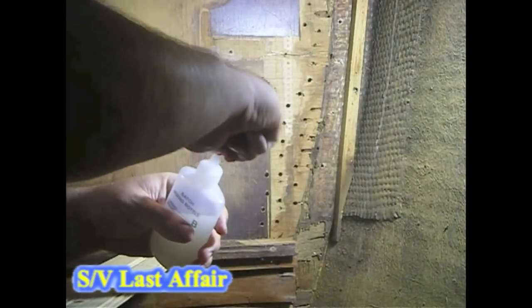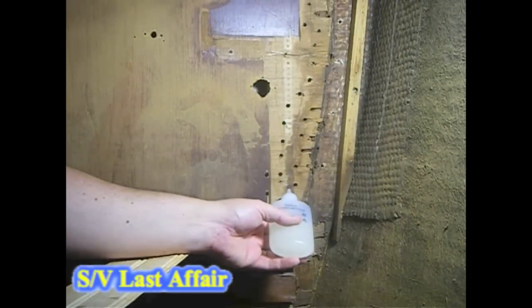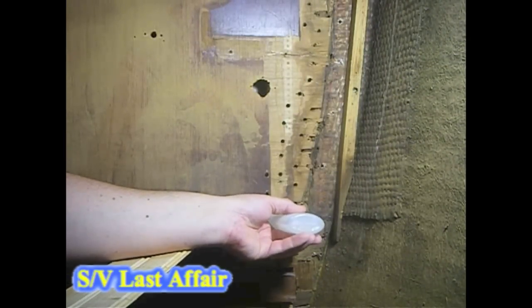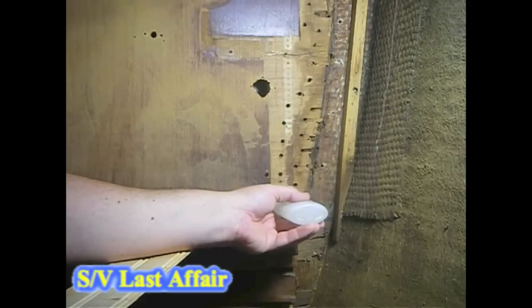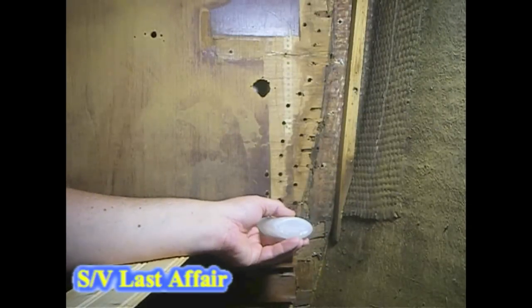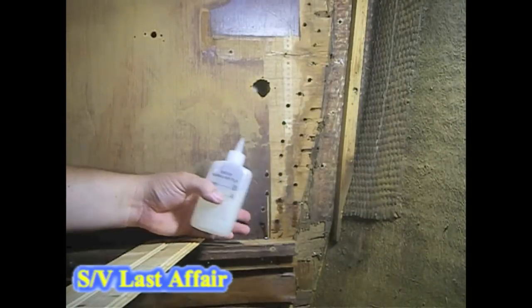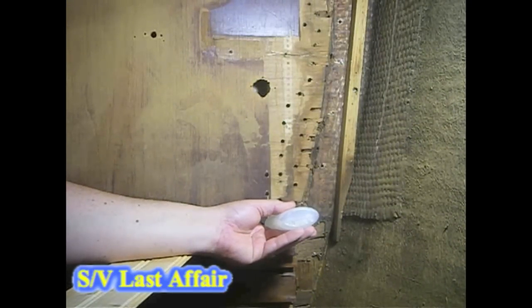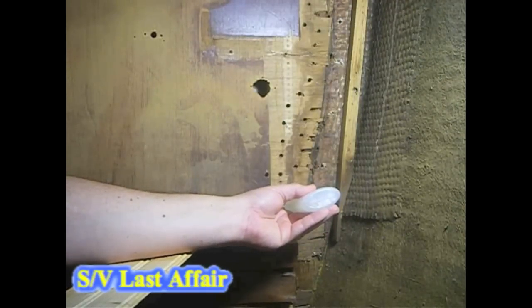That has been one full minute. I'm going to remove the lid and now we begin the process of inserting the epoxy resin into these holes. I'm going to start at the bottom, just injecting some in until it starts to run out. The thought here is that it's now penetrating down into the wood fibers. This is a slow process — you're essentially letting a little bit soak in and then trying a little bit more. Over here where it's a little more solid, it's not soaking in as much as in the other spots where it's more rotted. Here, if I inject it slowly, it's almost absorbing into the wood as quickly as I'm letting it drip into the hole. That's a good sign — it tells me it's really working its way down into the fibers.